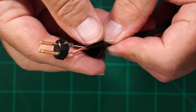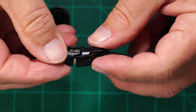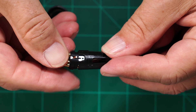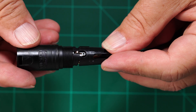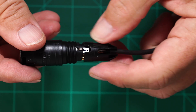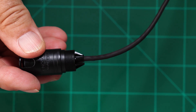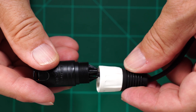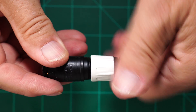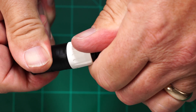Place the cable strain relief over the cable and align with the XLR insert as shown. Then insert this into the metal XLR shell until just a bit of strain relief is showing. Slide the XLR boot up and screw the assembly together. Repeat for the second XLR connector. Congratulations, you are now finished — so let's test this puppy.